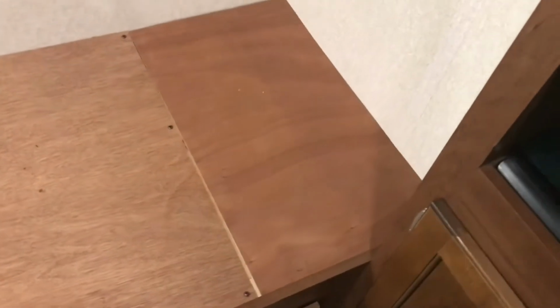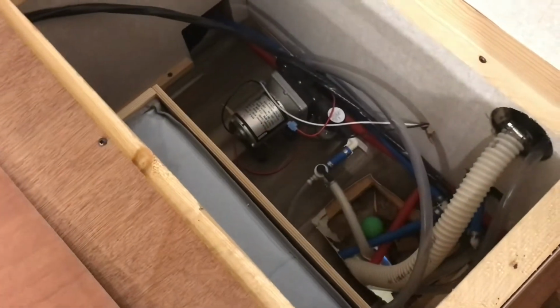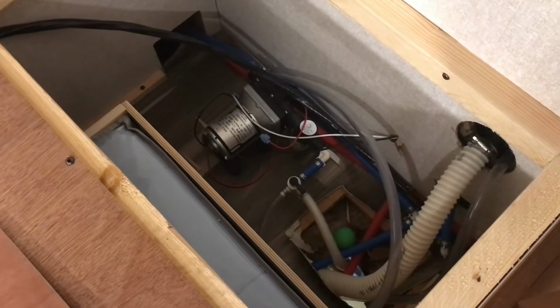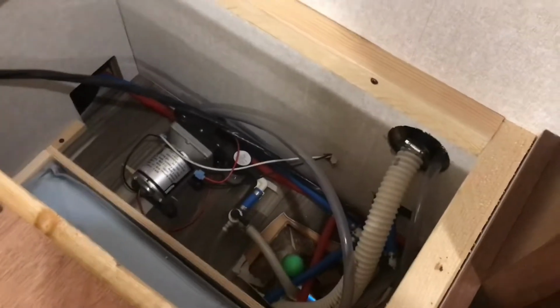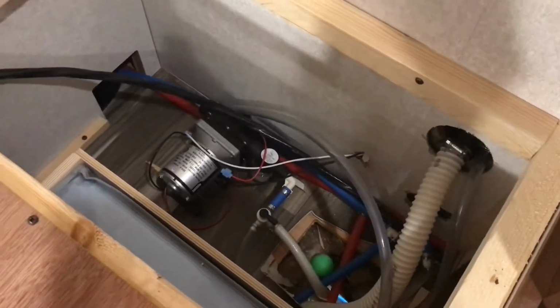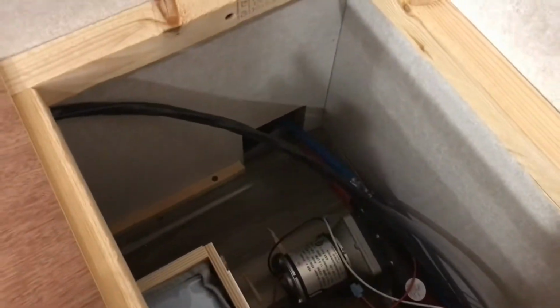In the 33 RBTS, this wall is the bunk wall, but it's also the back wall of the outdoor kitchen. Underneath of the lowest bunk, there's an access panel. You can just see that right there. You can get to your water pump, your electric pump. And so what you're going to do is you're going to take a gallon of antifreeze, and I'm going to set it right down in there.